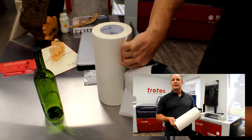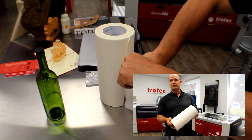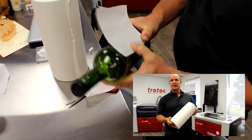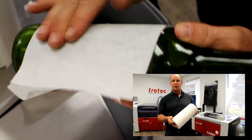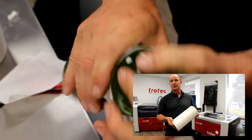To get a good quality and consistent edge on the glass, we can use two types of masks. One is wet newspaper, but the problem with wet newspaper is that it tends to dry out very quickly. So what we typically do is use this masking — it's wider and it's a low tack, so it actually comes off very easily once we remove it. It's also water-soluble, so we can rinse it off.